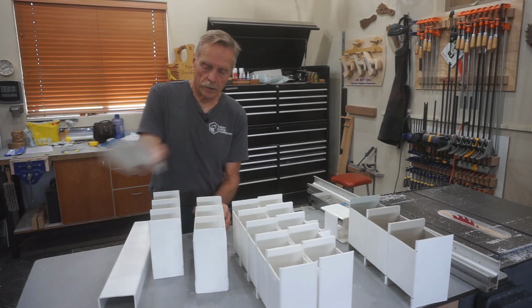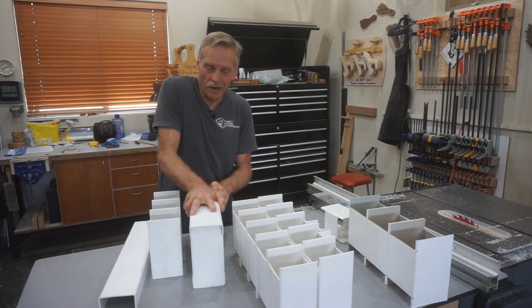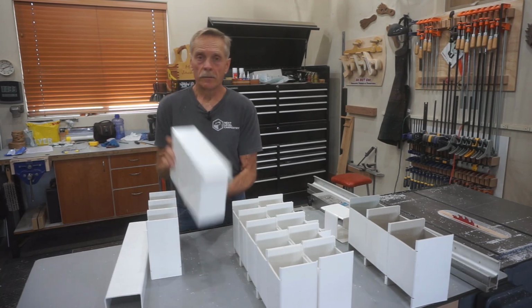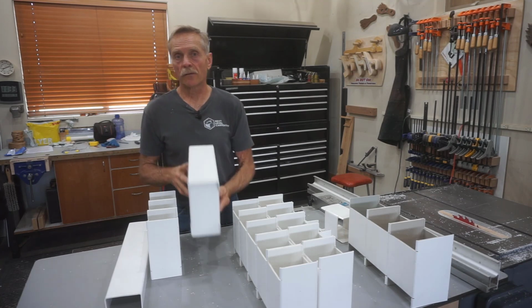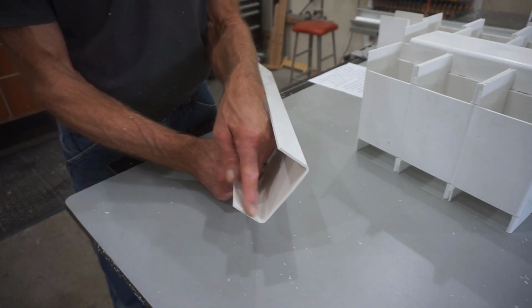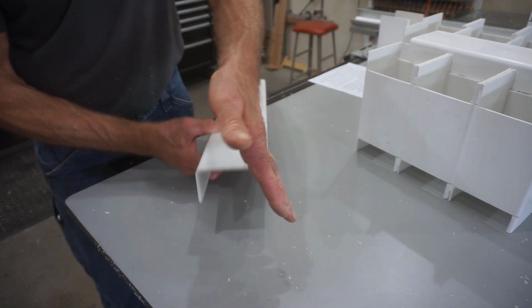The tricky part is if these cuts are made too shallow, the lid's hard to get on and it doesn't fit flush. But if the cuts are made too deep, then the lid won't fit snugly in place and just falls off in use. Because the wall thickness of tubing from some suppliers tapers out of the corners, you might need to set your blade at a 1 or 2 degree angle for a good fit in your situation.